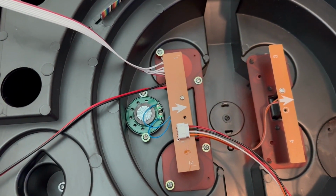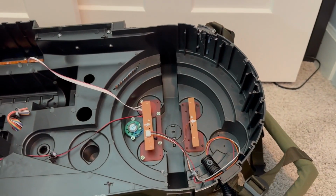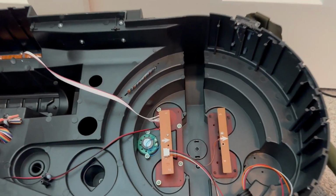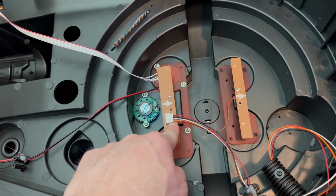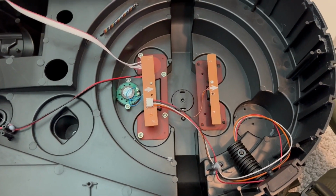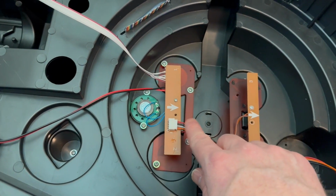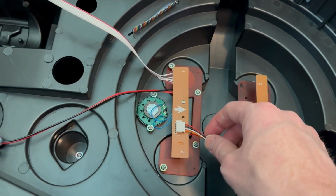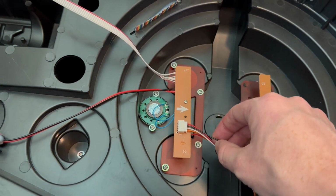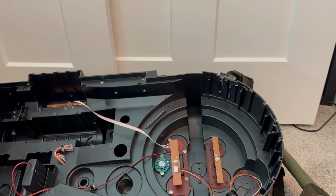And then of course it has the speaker output, the output to the other LED board, and the output to the power cell LED. So just to cut this short so we're not going long-winded, I'm going to take this connector off and then take the wand completely out, non-destructively, so I can keep this if I ever want to plug it back in. Then I'm going to make a new connector that goes in here with basically just a button wired up, and probably hide it on the back of the pack or somewhere that I can use to turn the pack on and off.